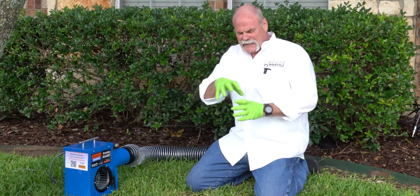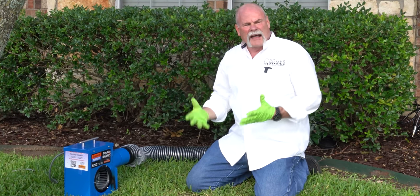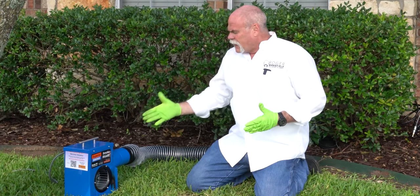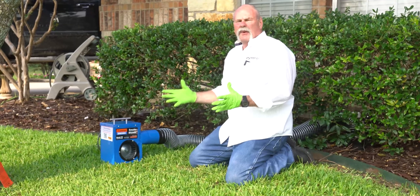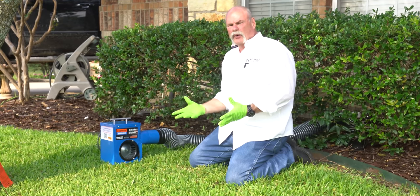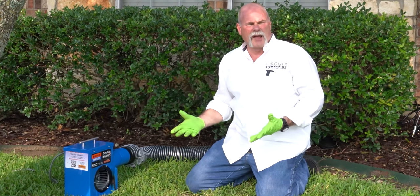If I ever do anything like that, what I do is I take a piece of foil and make a foil cap that I can just overlay it. That way it's light enough — the pressure will blow it up. I don't ever want to force any water out of any P-traps, so I don't want to cap them off like some people do. Now, the thing is we use smoke candles and smoke candles are not bad for you. The smoke candles are non-toxic. They're white and gray in color. They're not going to damage the house because you're not trying to fill the house with smoke. What you're trying to do is fill the plumbing system with smoke, but then if the smoke comes out anywhere in the house, that lets you know where you've got problems.